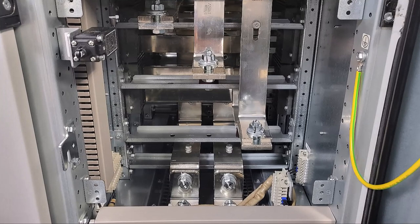Within the supply unit cubicle, measure and ensure the DC voltage between the positive DC bus and the grounding bus bar, and negative DC bus bar and the grounding bus bar, and positive DC bus and negative DC bus bars is at zero volts.